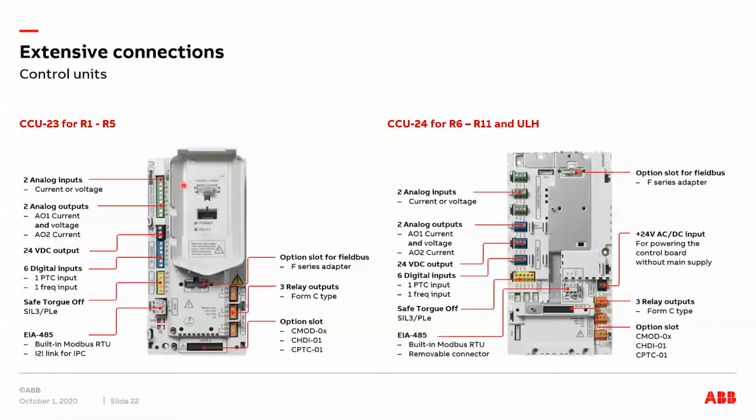And there you'll see that the terminals are color coded. For instance, your analog inputs will basically have a green terminal. The digital inputs have a yellow terminal. So they basically color coded it just to make it a bit easier. Then looking at the front here, that is of course where your graphical display will be plugged into. When you lift this cover off, there is a slot to add in things like your Profibus card or your Ethernet card, etc.